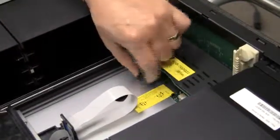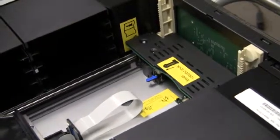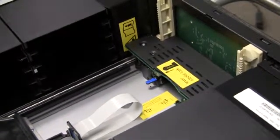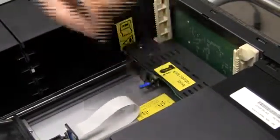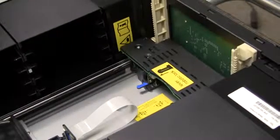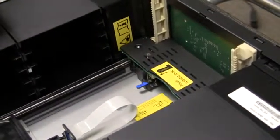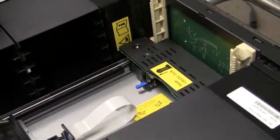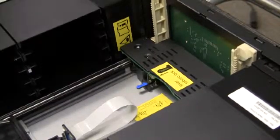If you put it in the unlocked position, you should see it gently fall. Wait, then lock the carriage once it's at a lower level, and you're done. Go ahead and put the top cover back on the library, then power the unit back on. The library will unlock itself and calibrate itself, and you should be good to go.